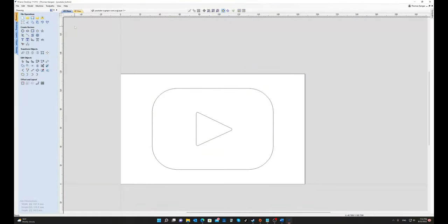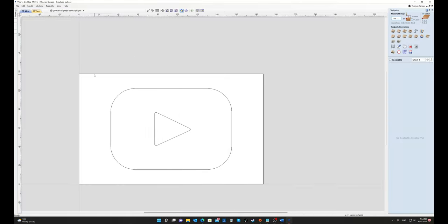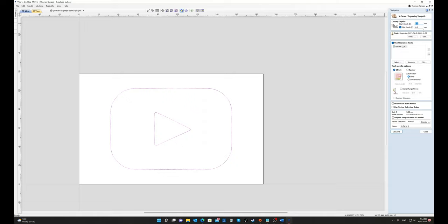This video is a quick and dirty tutorial on how I do my v-carve inlays. After I set the parameters for the workpiece and import the inlay, I like to set the initial pocket size for the inlay. I use a start depth of 0 millimeters and a flat depth of 6 millimeters. I use the metric system as my CNC is set up that way, but the same principles apply using Imperial or USA measurements as well.